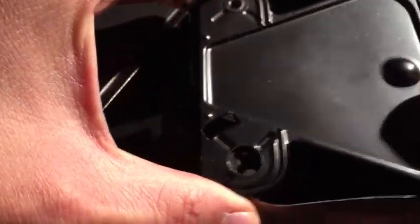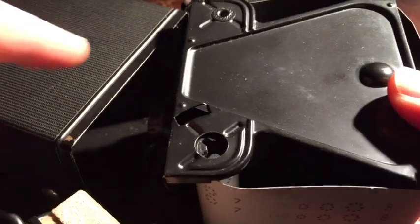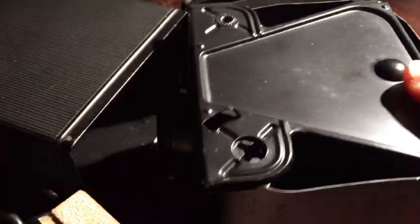This is the original film holder of the camera. It's clever that they put the optics and the film transport in the same frame, because that means the lens was always at the correct distance and angle to the film, even if the frame was put into the camera somewhat obliquely.